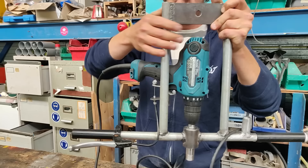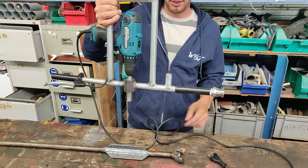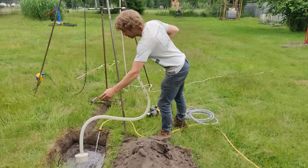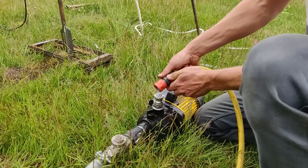The water will be injected here in the handle and will come out in the rotating shaft, which will be coupled to the drill stem. So we have a continuously rotating drill with water coming out at the bottom. To get the fluid going we use a very ordinary centrifugal pump. There is a filter on the end so particles and grass are not sucked into the pump.